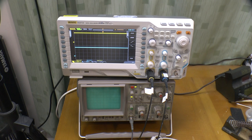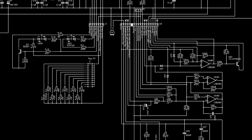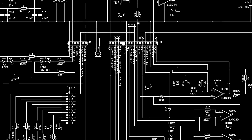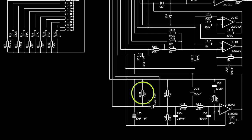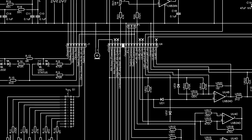That's most of the easy stuff out of the way. Now let's dive into the weird bits. The microphone feed comes straight into the daughterboard marked U4. There's no component numbering on this board, so I've had to basically make all the numbering up, prefix with the U so they don't clash with anything on the main board. The microphone gets its power from a bias resistor, and the resulting signal is also available at the edge of the daughterboard. It's just not used. I've assumed that this gives the choice between connecting a microphone which needs power on the same pin as its audio signal, or one which doesn't.